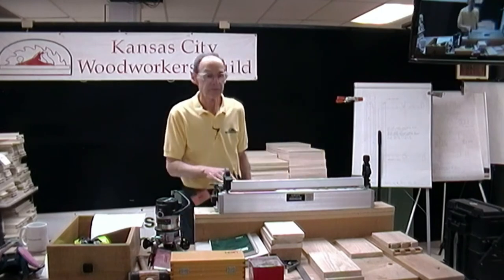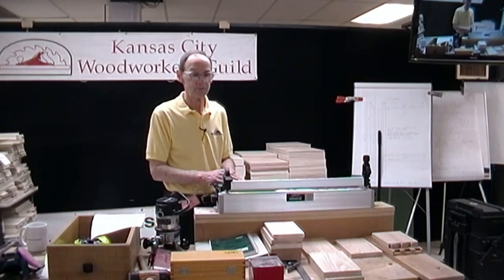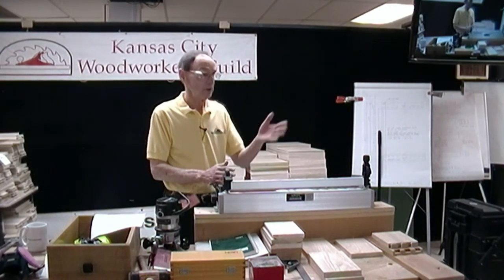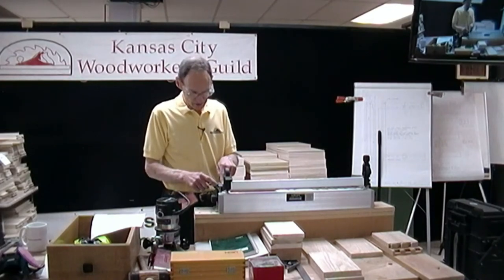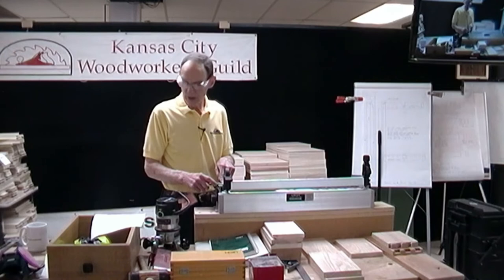If you were cutting through dovetails on that machine, would you use the same procedure, or is there something else that you'd have to do, a different setup? Well, for through dovetails, which I have not done in this jig, I want to be honest in saying right up front, Joe, and maybe somebody who has can answer the question better than I, but you use two different bits and you use different scales. The scales that you need are on the jig as well. And the bits you need